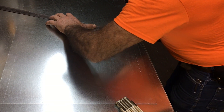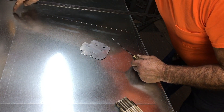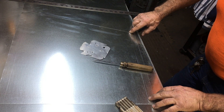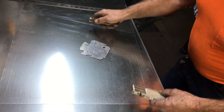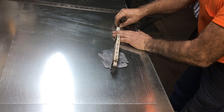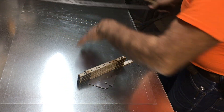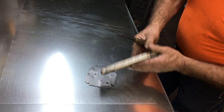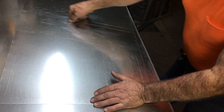This is going to get folded in and have a drive tab bent out, and the other end folded out with a drive tab bent out. So your actual fitting is one inch in to one inch in — that's your real dimension. Now that we've got this angle established, we add one inch to it for the Pittsburgh, right at that angle. If you had added that one inch without establishing these two points first, everything is going to be off and that one inch is going to end up being about seven-eighths of an inch, which means the Pittsburgh will eat into your duct an eighth of an inch or better.